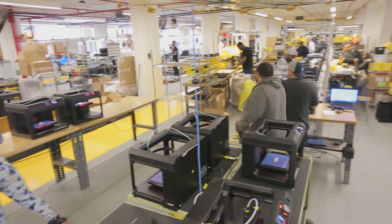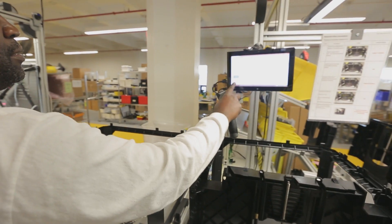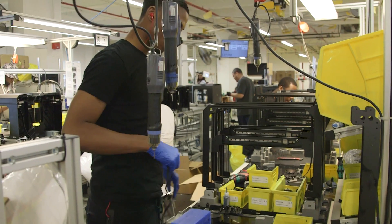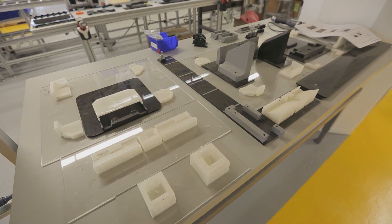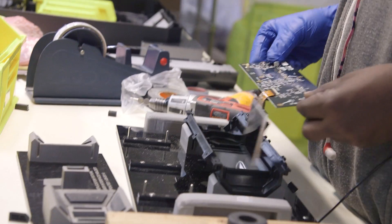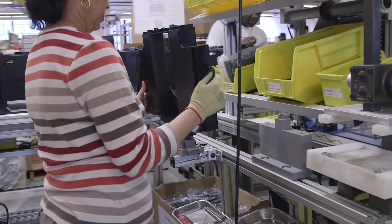When you're looking at starting a factory or an assembly line, you need to look at the product and figure out the most efficient and consistent way to build it. To do that, you look at the most critical areas first. Where could you possibly have a quality issue that can be prevented with a fixture or a jig? Something that needs to be precisely the right height — you might create a spacer jig. Something that needs to be protected cosmetically and could possibly move while you're assembling onto it — that would need a fixture.